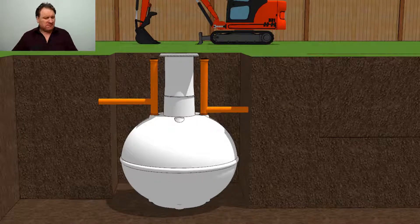Because fiberglass septic tanks are really light, there are two dangers to look out for. Number one: if you hit them with the digger bucket, it will puncture them and ruin the tank — so be very careful when lifting it into the hole. Number two: they're very light, so if there's a bit of rain, the tank can pop up out of the hole and above the grass.